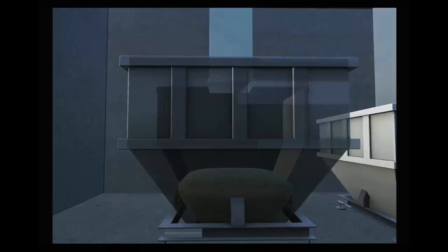Screw conveyors are the most common method, but smaller mills may use air gates for ingredient bins located directly above the scale. Air gates open to allow ingredients to fall from the bin to the scale using gravity. The air gate will also jog, or open and shut quickly, at the end of the run to allow a small amount of product to drop onto the scale.